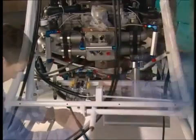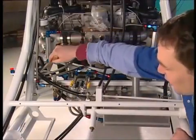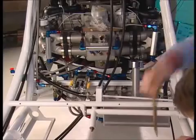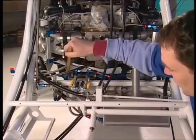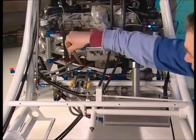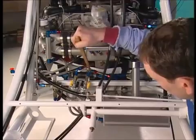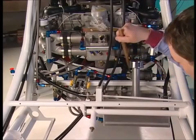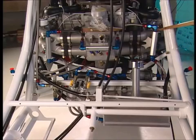If you think it looks complicated, it is, and I will try and take you through it. You start over here — this pipe brings in the fuel from the tank on that side, and this pipe over here, which runs underneath, brings the fuel into this T-piece. It then goes through the shut-off valve here and the first primary filter in there, through the fuel pumps, back out here and here, through to another T-piece that's on the input side of the fuel filter, goes out of the fuel filter, up this pipe, into the fuel rail.